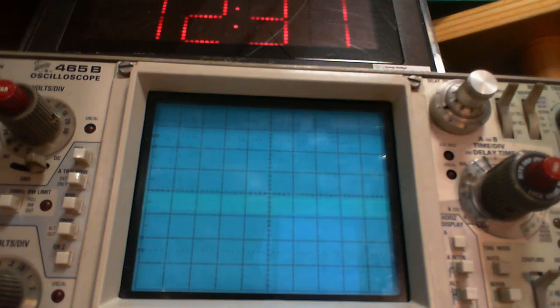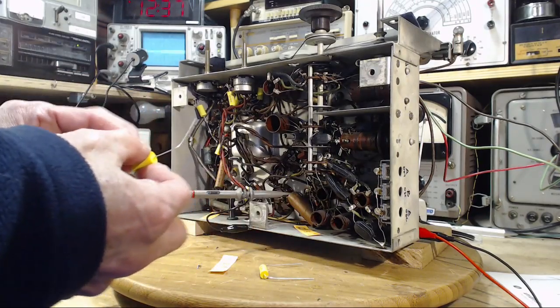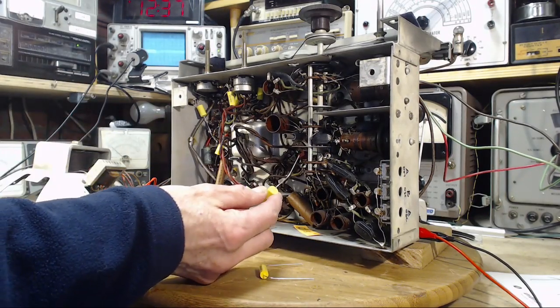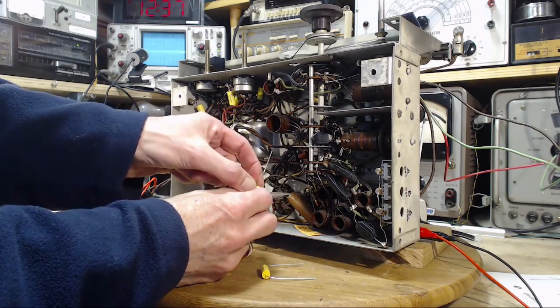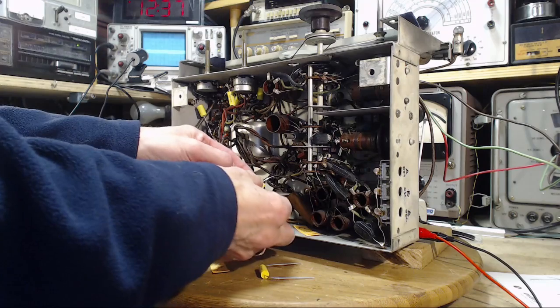It's only supposed to go to the chassis, so I can just touch the top and the chassis at the same time. Here, you can watch me do this. Okay, holding on to a capacitor is just not the safest thing. That'll be the ground. Watch out for the other end. And now we're going to swing it down. I don't want to be touching anything.